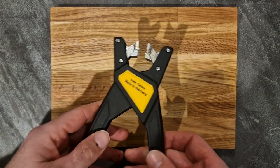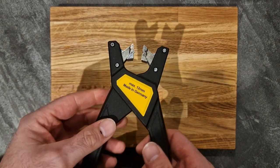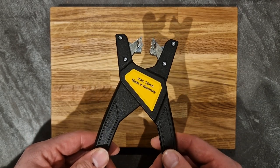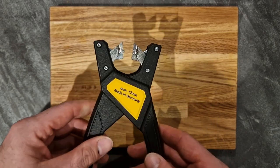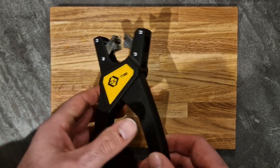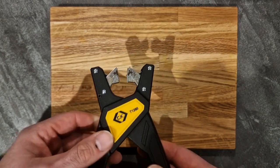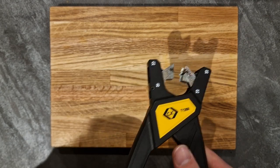These are very similar to the Quick Wire cable strippers, which I believe are made by a UK manufacturer who also provide junction boxes for lighting. So these are predominantly flat cable strippers. This is the first time I'm using them and I'm going to test on a couple of pieces of two-core and CPC — twin and earth cable — doing 1.5mm and then 2.5mm.